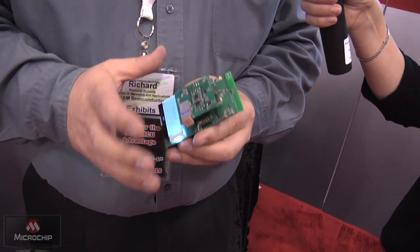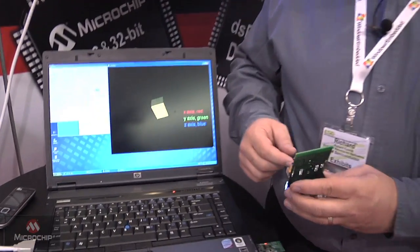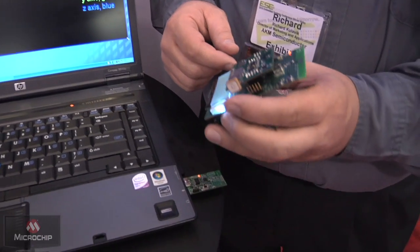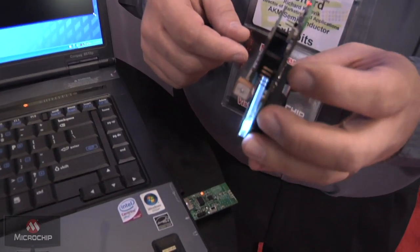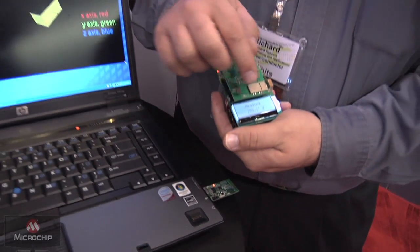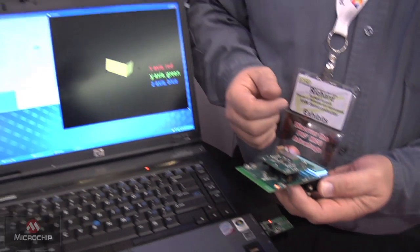We picked that part due to its low power consumption. The board itself will do all the calculations to detect pitch, roll, and yaw, process them in the PIC here locally, and then shoot it across a wireless link over here to the PC. Once it's sent across the wireless link, you can see the orientations displayed on the PC. The data calculations are also done locally on the board and displayed on the screen itself or on the PC jointly.